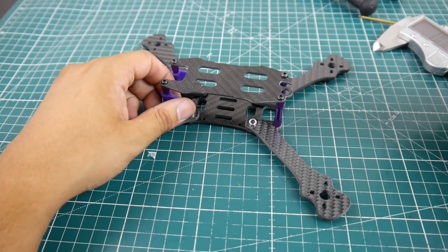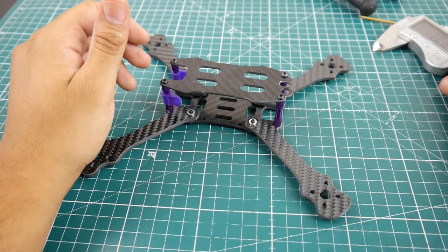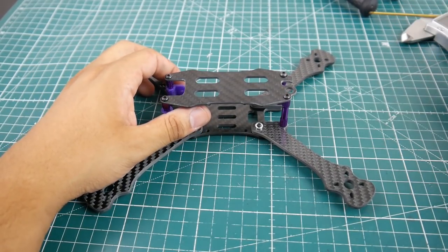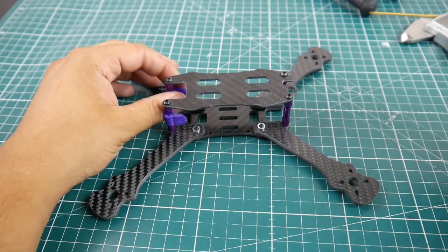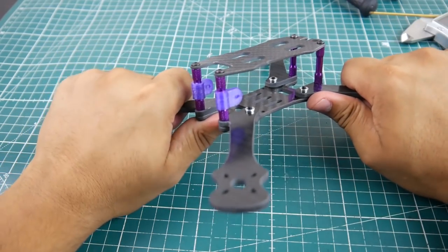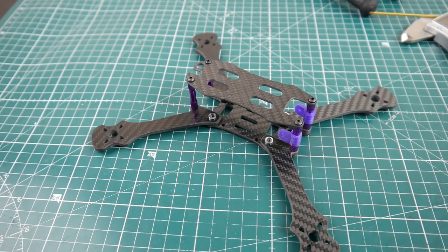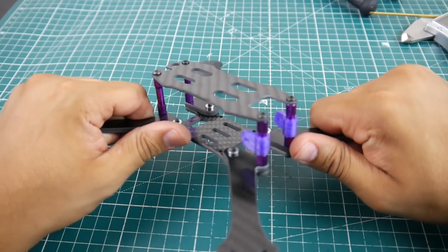I have an update video coming up on an F7 build on a seven inch Jeb RC Mark II, and no matter what I do I cannot tune out the vibration issue. We're going to replace that frame — even though it flew very nicely on the MPU 6000 gyro, with the Holybro F7 and the ICM gyro, even adding capacitors didn't help. It's the frame itself. As we see more F7s with sensitive ICM gyros, arm play and frame flex can play a big role and may mean you'll never be able to tune it properly.